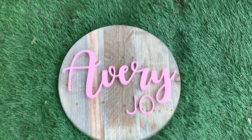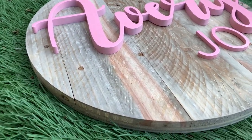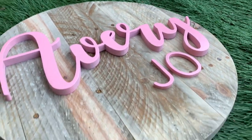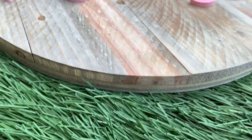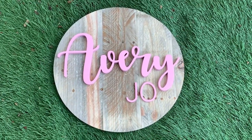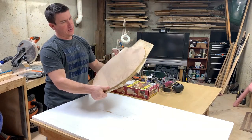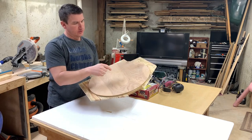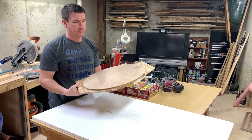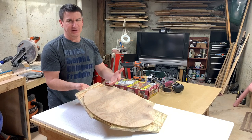Welcome back guys, it's the Tightwad. Baby name nursery signs are trending and have been for about two years, and most of them are on round wooden signs. I'm going to show you today how you can cut these nice round wooden signs with a simple jig and a router. I have these pallet boards connected to some plywood — it's already round but had some issues on the edge, so I'm cutting a smaller one today. This is a 20-inch round originally, going to be an 18-inch round for this customer, and I'll show you what I do to cut circles out of plywood or to make signs for people.